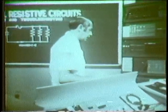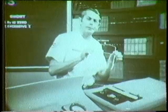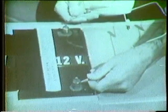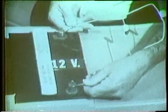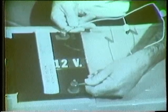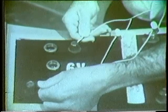Another factor that determines power is voltage. To show this I'll use these bulbs which are wired in a parallel arrangement and two different batteries. If I connect the bulbs to this 12-volt battery, notice the amount of light being produced. We can say then that the filaments are dissipating a specific power. But when I connect the same bulbs to this 6-volt battery, you can just barely see that they're glowing. It's pretty obvious that there's very little light here. Then the bulbs are dissipating much less power.